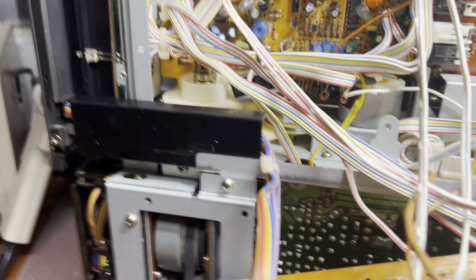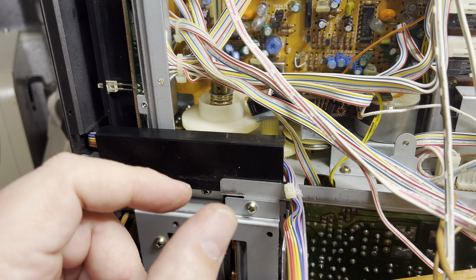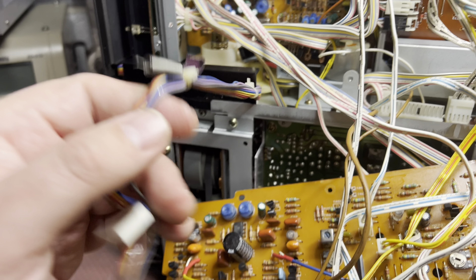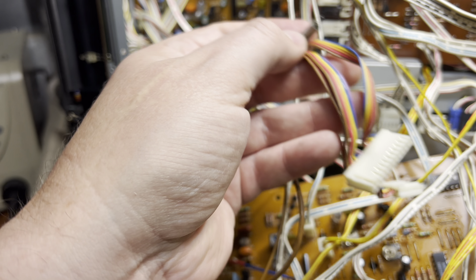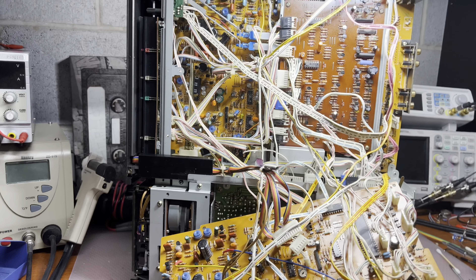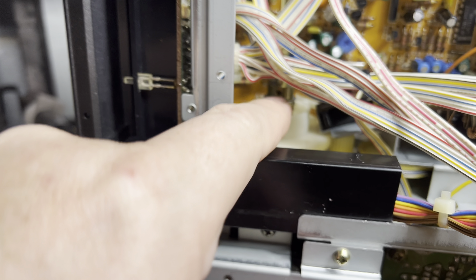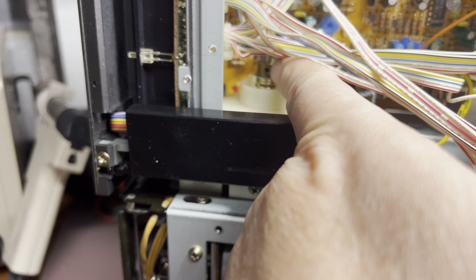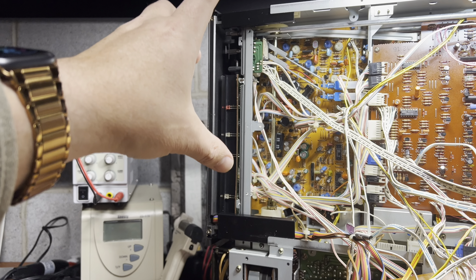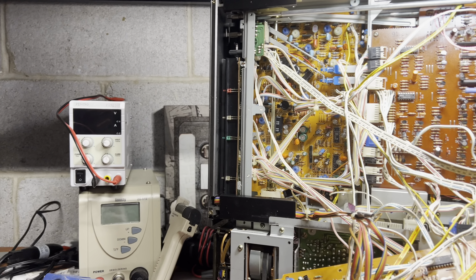Done — that's how it works. The friction mechanism — I believe it was just stuck due to not working for so many years. Now I have to connect these connectors, put the spring back, and we can test how everything works. Long journey to understand. And here we have a screw inside which we can adjust — the position between the top gear and lower gear — to make sure they work in sync and the door closes properly with the proper angle.